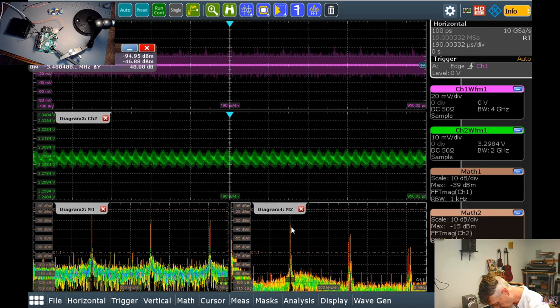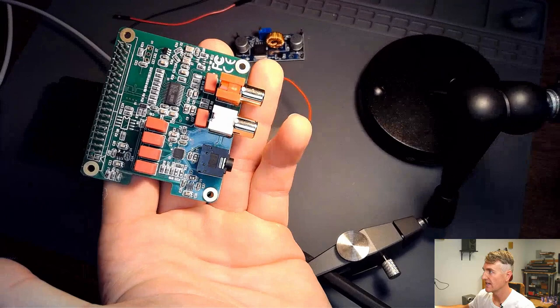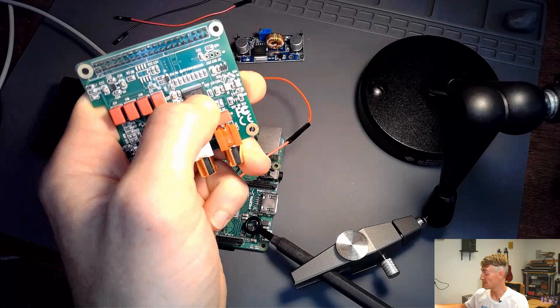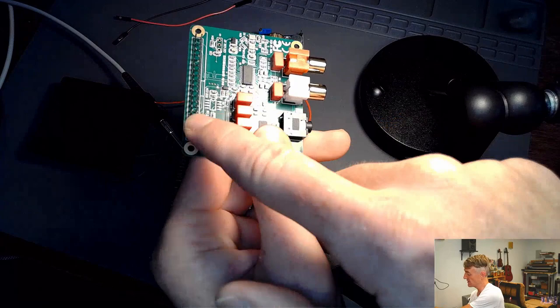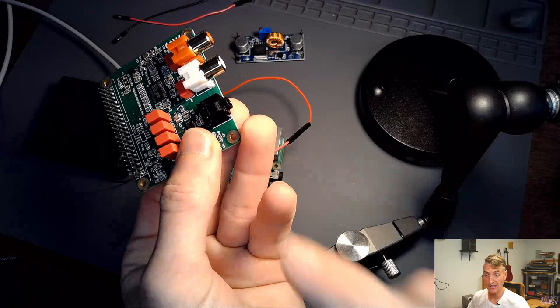Up here. So I had this digital analog converter right here, and I did do an experiment that used it, which has the same kind of chip that I was using. Well, it's even a nicer chip: the PCM5102 is what I was using, this is the 5122, and it has the audio jack out that I needed. When I used this Pi hat, which has as good of a ground return path as one can have, because every ground is connected through this GPIO header back to the Raspberry Pi, this output has hiss on it. It has the hiss from the power supply of the Raspberry Pi.